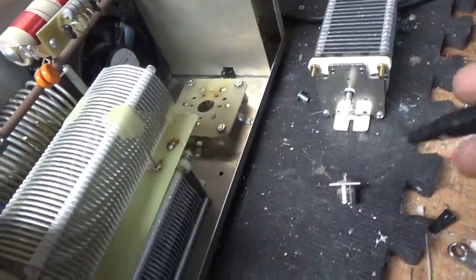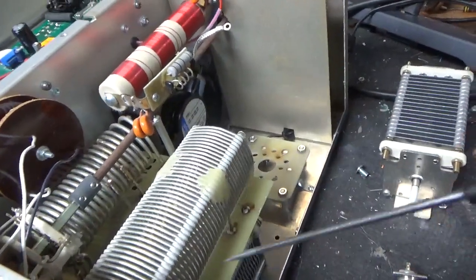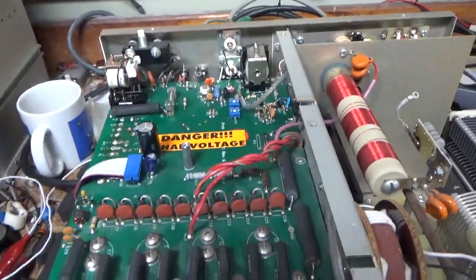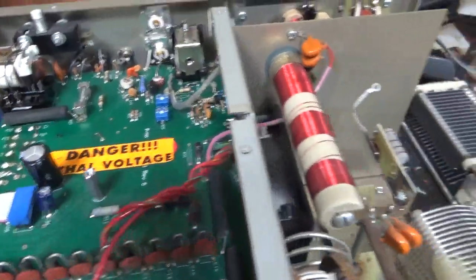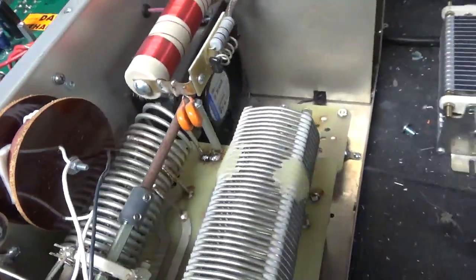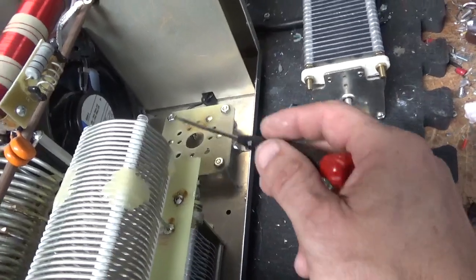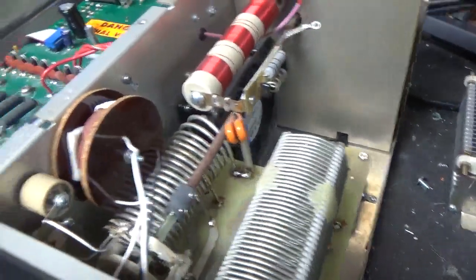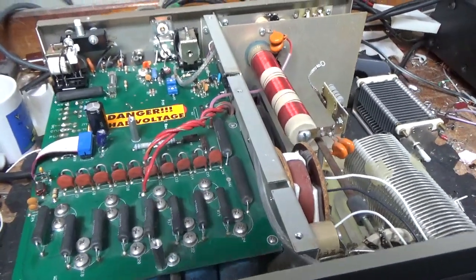Added the gas discharge tubes, grounded the grids right to the metal, tightened up on hardware, fixed the plate centering issue on the load side — showed that before. Touch-up on solder joints, replaced the SO239 connectors, cleaned the relay contacts really well with Deoxit Gold, cleaned the input rotary switch and the output rotary band switch with Deoxit Gold. A couple of the nuts were actually loose between the standoff and bottom of the socket, so I tightened those up, and tightened up the four nuts on the top. That's about it.